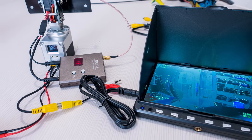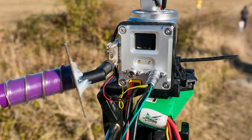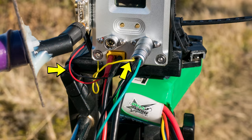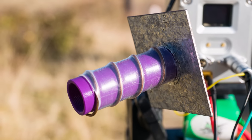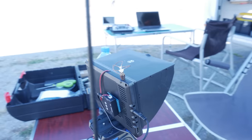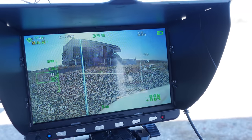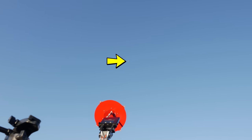Initially I used the video out cable to connect directly to my monitor, but since I didn't want to be tied down with cables, I modified the connectors and soldered cables to power and feed the video to a lower power output video transmitter, which uses a left-hand circular polarized antenna to transmit the video to my monitor. I use left-hand circular polarization for the relay setup because I am using right-hand circular polarization for the link between model and tracker, and this reduces the chances of the relay interfering with the receiver on the tracker. So once adjusted to point at the model, it will just track during the whole flight.